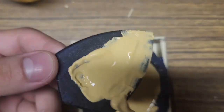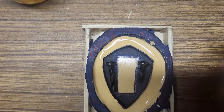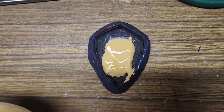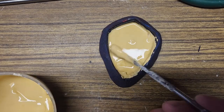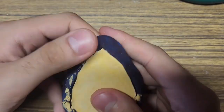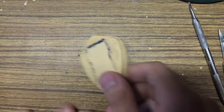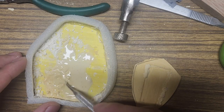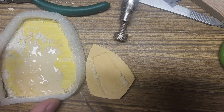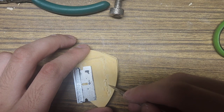For these reasons, I decided to try using a material called dental stone. This comes in the form of a powder used by dentists to create extremely accurate and tough impression molds from patients' teeth. Unlike plaster of Paris, it does not break apart easily, and as long as you cast it with a thickness of about 1cm or more, it can withstand a lot of force. This makes it ideal for my use case because it is extremely cheap — about 10 to 15 dollars a pound. Also, if there are any issues with the surface finish, such as air bubbles that got stuck, you can easily repair the mold by filling in the gaps with more dental stone. It is also a lot less messy and sticky than epoxy resin, it can survive high temperatures, and it doesn't really smell. All you have to do is mix with some water and pour.